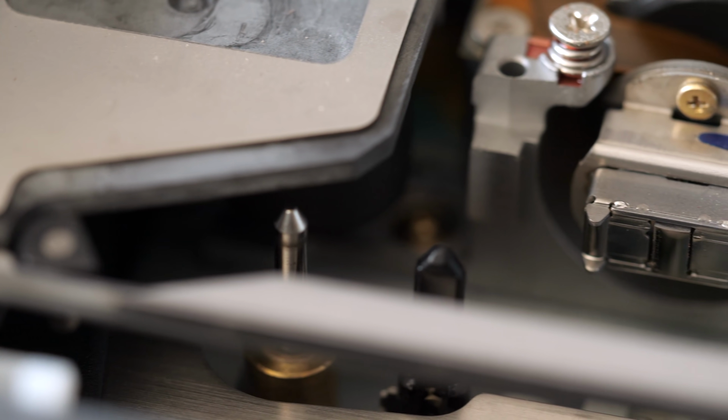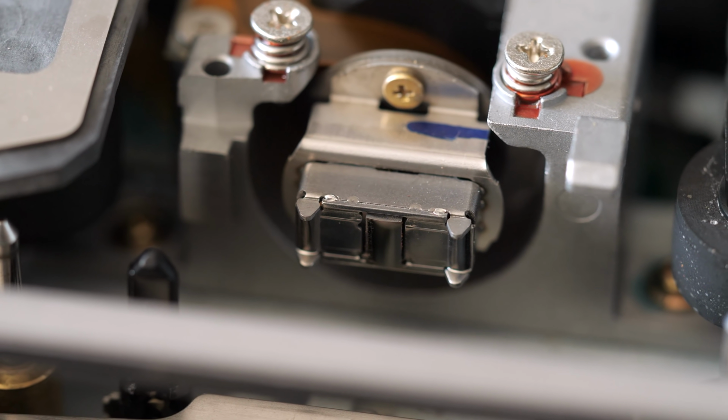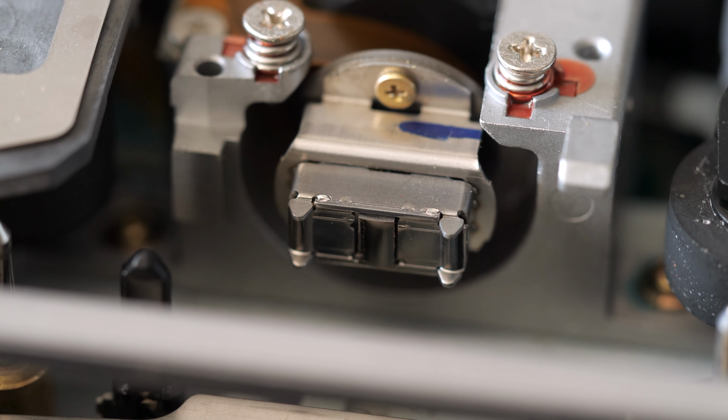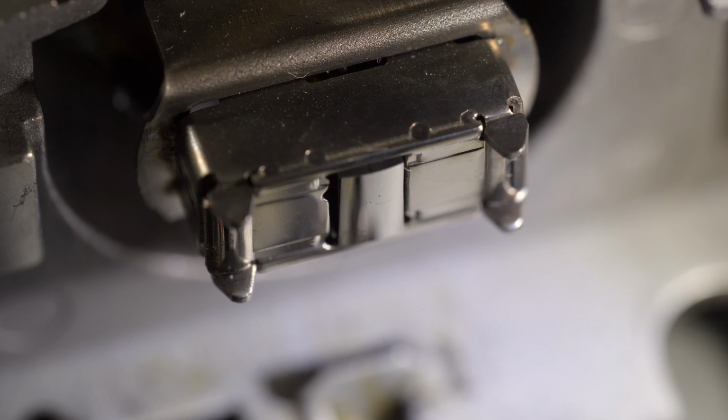This could have been due to the read-write board, but it also could have been a problem with the tape head itself. The heads used in DCC decks are not like normal tape heads, and apparently are not just susceptible to getting dirty, but are also prone to failure. So that's the path I went down next. I did notice that the head in my deck was a little dirty. Nothing horrible, but even after gently cleaning it, the problem was still there, as I kinda expected.